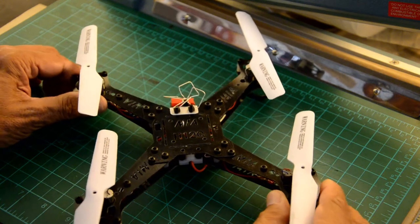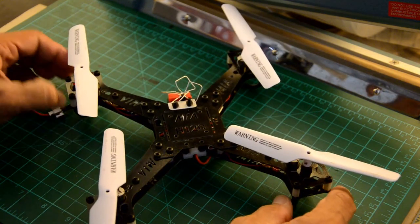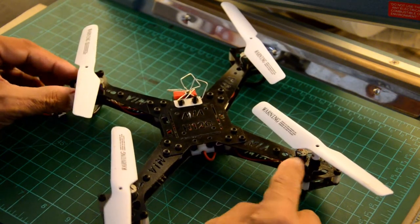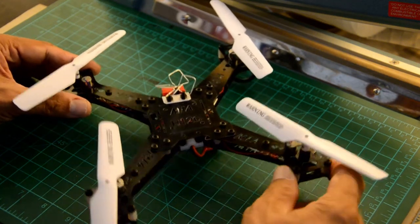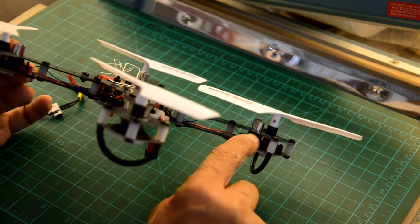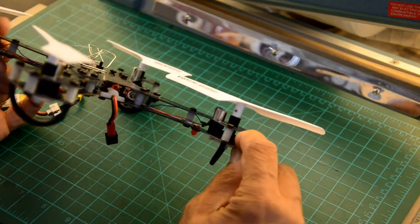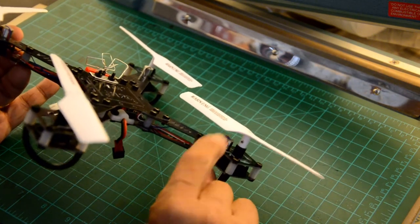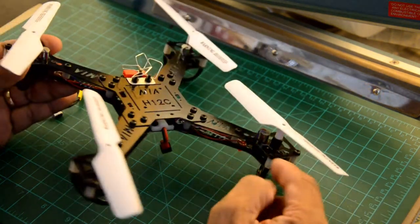The sandwich-form design protects the gearboxes and motors. The motors won't come loose because they're held by pressure via rubber O-rings acting as spacers between the gearbox and the top plate. When the frame compresses, it compresses those rubber rings, holding the motors and gearboxes in place simultaneously — no screws or additional hardware needed for that.